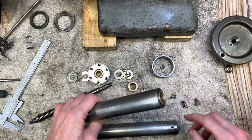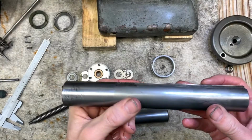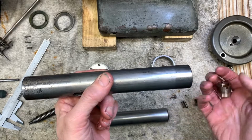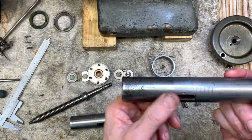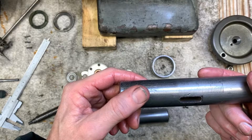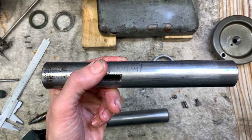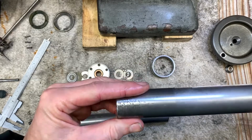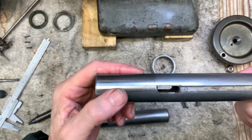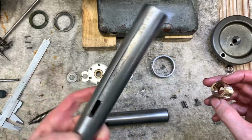I think that was so tight in this old spindle, they just didn't quite get it in. So then of course they welded it, the part's hanging out the back, so when they retract the tailstock it doesn't eject properly, so they then waller on the end of this, and then someone thinks, oh, it's not ejecting properly. If we take the thrust bearings out of this end, it'll get back all the way. So anyway, tragic, innit? Probably most of the abuse that this thing suffered stemmed from that original nut just being too tight.